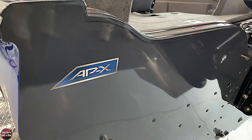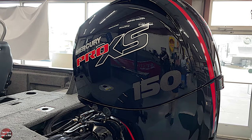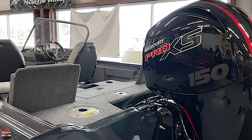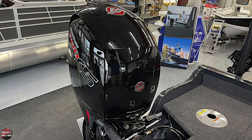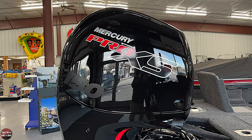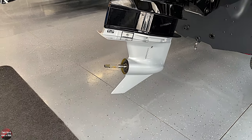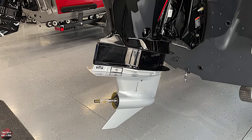Let's talk about the motors. These come from 90 horsepower all the way up to a 150, which is the max. Max horsepower on a 1750 in the jump seat configuration is 150. This particular engine is a 150 Mercury Pro XS. The Pro XS is a small step up from the standard 150 — they use an entirely different gear case, which some people call heavy duty. It's a different gear ratio, and the Pro XS also has a slightly higher RPM range than the standard engine.